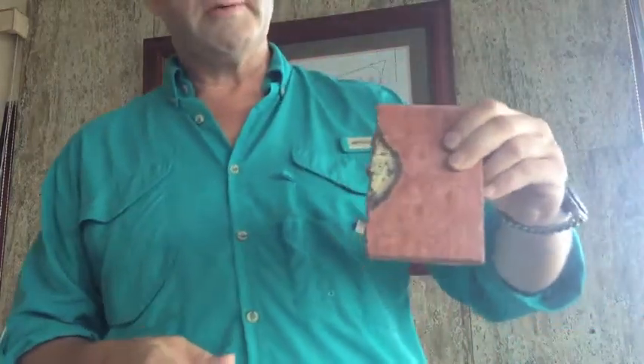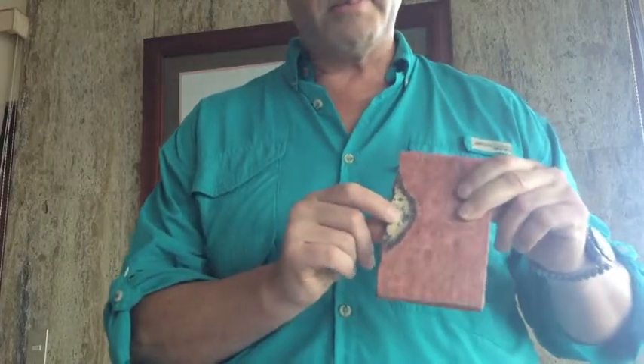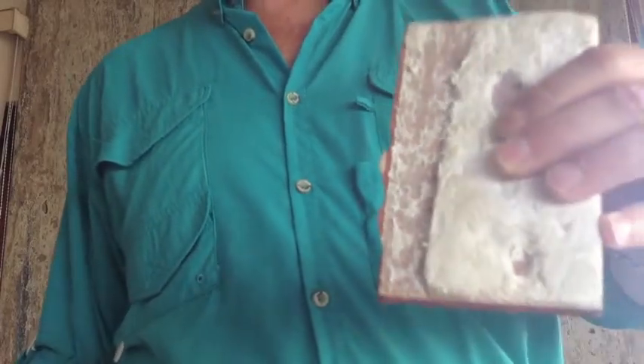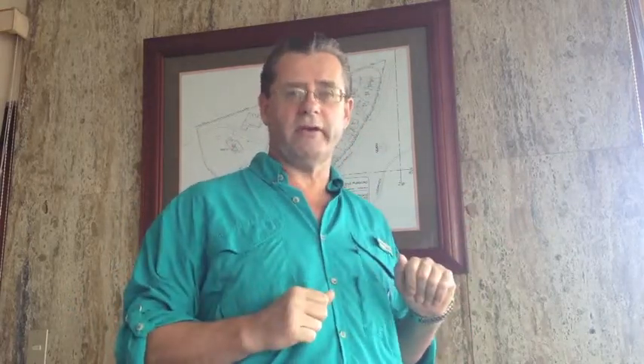Something to bring up about the magnesium for roofing: this is a sample of a piece of magnesium panel that we took and put an acetylene torch to — 2,400 degrees. It does not burn. Very interesting when you look at the back where the styrofoam is — nothing is even yellow. Styrofoam burns very easily, so this does not transfer heat. Magnesium is a great protector against thermal transfer of heat or cold. So when that goes on a roof, we do not need insulation. And if somebody wants to dress up the house more with a plastic roof, they can put magnesium on top of it first.